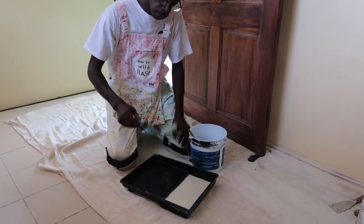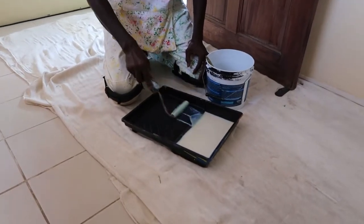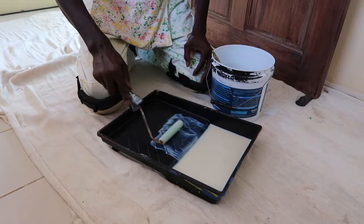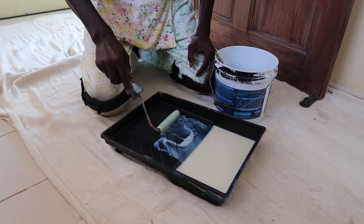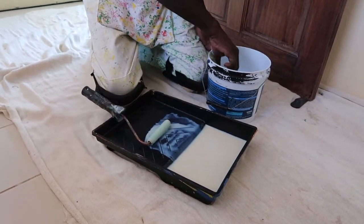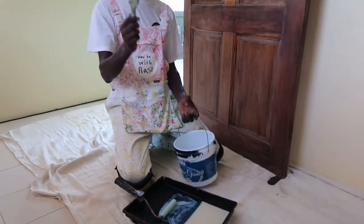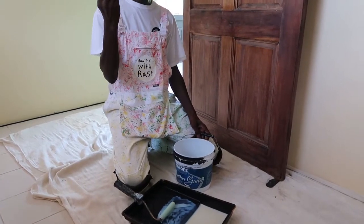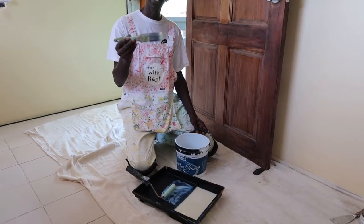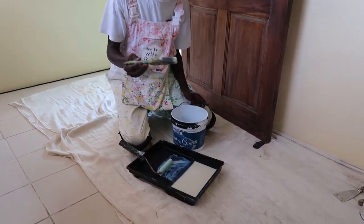So what you then do, you've got to break it in in the varnish, load in the roller, and as you can see, the varnish is a creamy whitey color. So you load the varnish onto the rad roller sleeve, and we also have a 1.5 inch brush. Now this brush is a synthetic brush, which is made for acrylic paints and acrylic varnishes, acrylic oils, anything that's acrylic, and acrylic is obviously something that is water-based.